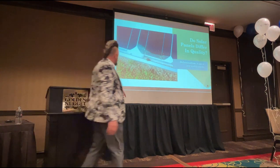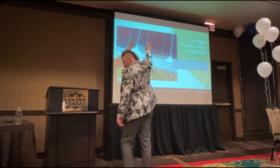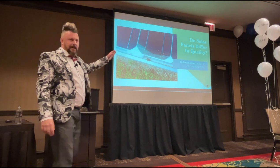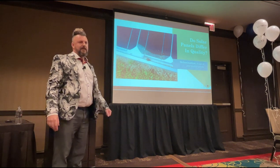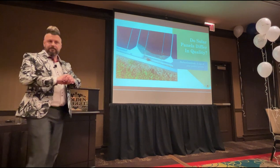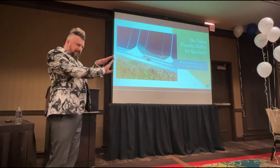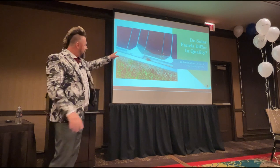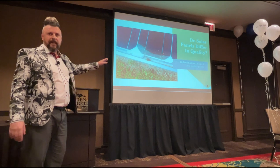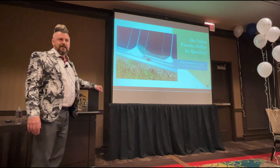So here, we've got this section of the solar panel which is a different colour to the top section. You should always have a uniform look on solar panels. This process is called delamination. It's a sign of poor quality panels. Cheap panels, you get delamination. This is where you've got your glass on top and then you've got silicon underneath and the silicon is moving away from the glass. Okay, so you've got this separation. Delamination. Okay? Not an electrical risk, by the way. If ever you do the ISCA training, that's one of the questions: is delamination an electrical risk? It's not, no.